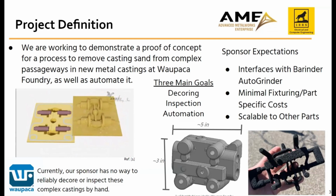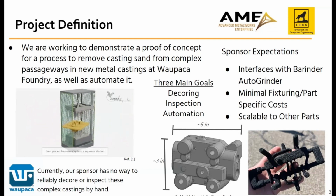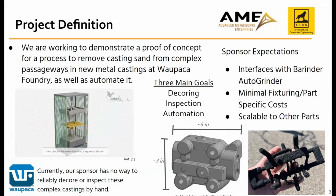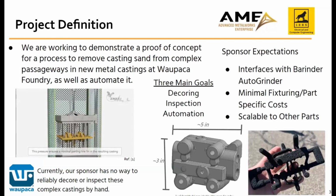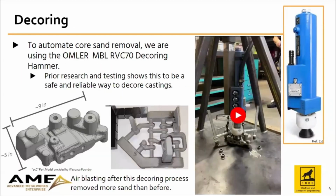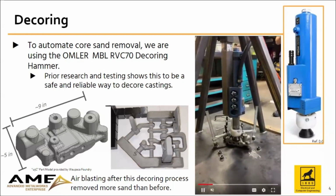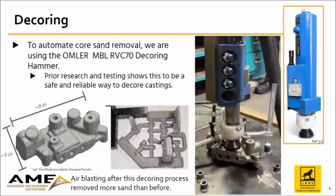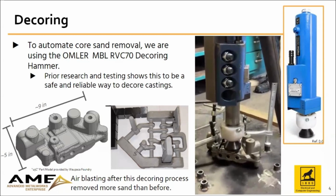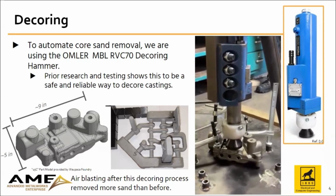Our main goals for this is to figure out a way to decore the casting, inspect it after it's been cleaned, and then automate the processes as well. Our sponsors don't currently have a way to do any of this by hand, so it's a big undertaking for all 7 of us. To test this method of core sand removal, we are using the Omler MBL RVC70 decoring hammer. Prior research and testing shows this to be a safe and reliable way to decore castings. On the right, there is a custom tripod mount for the Omler hammer with the respective casting clamps.